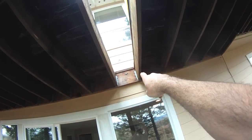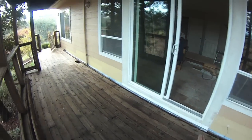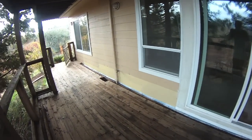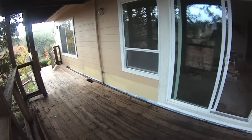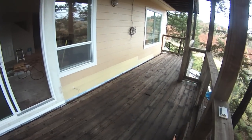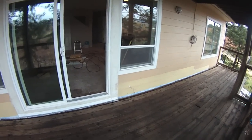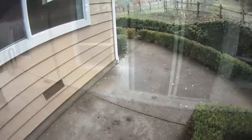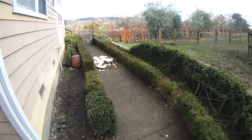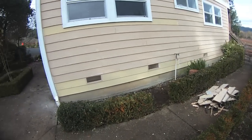I'm glad I thought about using cement board here, because we're never going to be able to correct the water coming down the face of this building — that's just the way it is. I'm just the siding guy; the deck is someone else's project. If you were to rebuild the deck properly, you'd have the ledger board stand off so the water would just keep going down to the ground — but that's not how it's built and that's not how it's getting rebuilt. So we work with what we have. That concludes the rotten siding portion of this project.